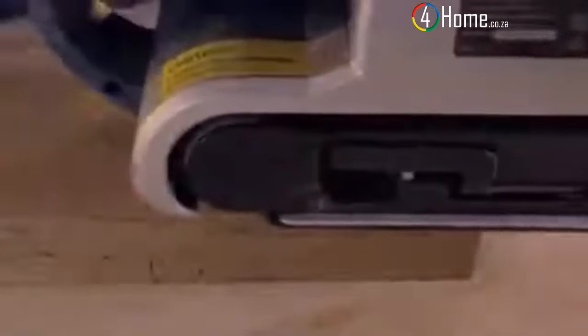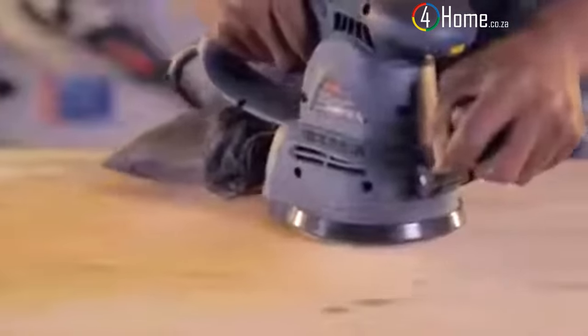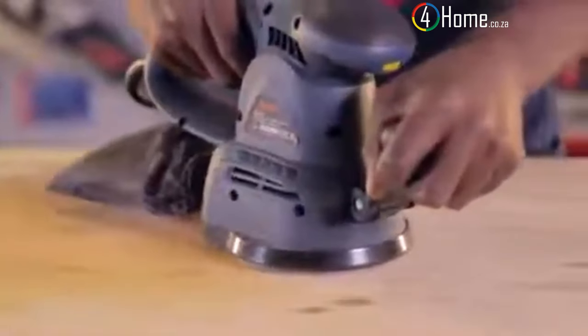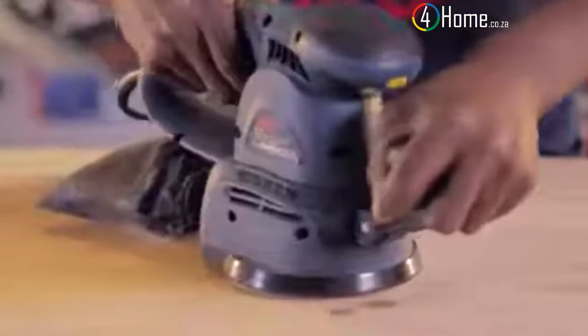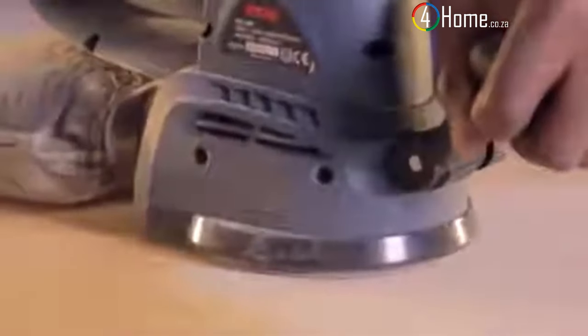When smoothing large flat surfaces, especially really rough ones, nothing beats the high speed and brute strength of a belt sander. Ryobi orbital sanders are lightweight, easy to control with one hand, and relatively quiet. It's also virtually impossible to damage your work with this type of sander. The round pad on the Ryobi RS250 random orbital sander moves in random orbits, meaning it vibrates in tiny circles, like an orbital finishing sander, but it also spins in circles. Because the pad vibrates and spins at the same time and has a vertical movement, it prevents the swirl that ordinary orbital sanders sometimes leave behind on the wood.